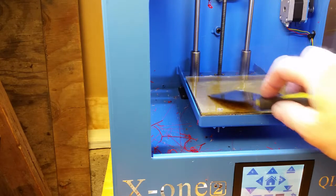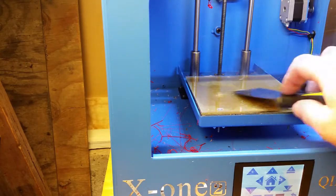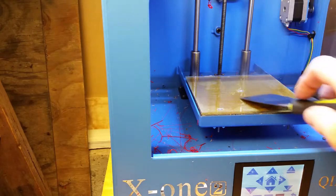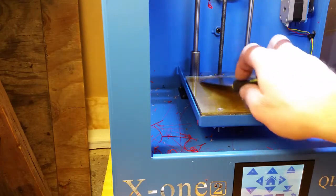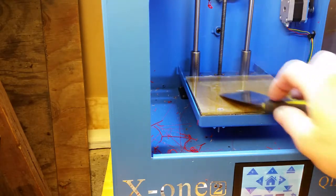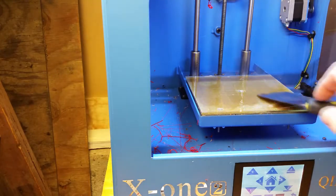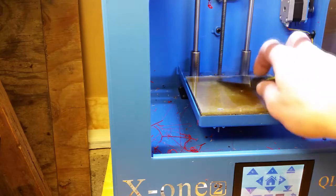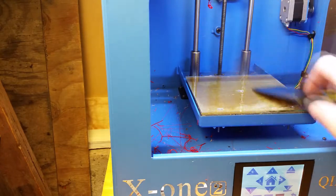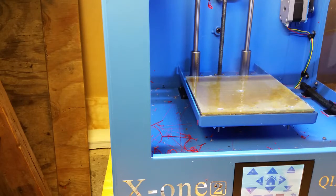When the bed is warming up, I just spray a few sprays of water on the bed, mix it around, and I don't have to add any glue — it seems to work just fine. I'd say I only add glue about every ten prints. If you did bigger prints you might have to add more glue, but I just make small parts right now. The PETG plastic for me tends to work better — it doesn't crack and is stronger.